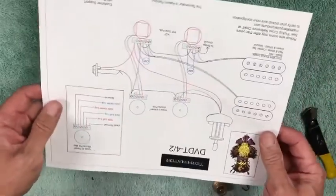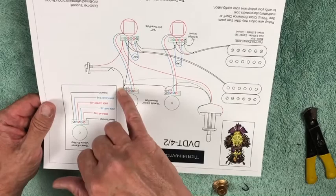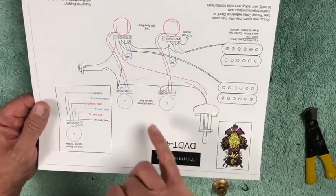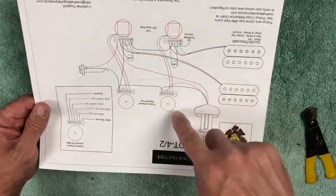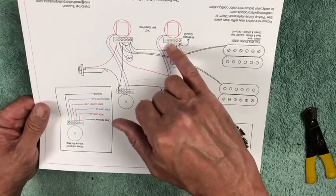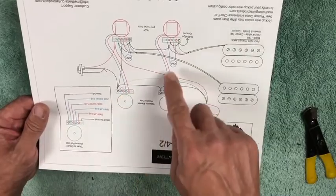Sorry about that, I had a little interruption, but what I was saying was some of the schematics, or some of the systems, where we have minimal contacts, here we have, let's see, 1, 2, 3, 4 black lugs, but we also have this jumper going over the center lug. So really, here we have 6 points where we can tie ground wires into.